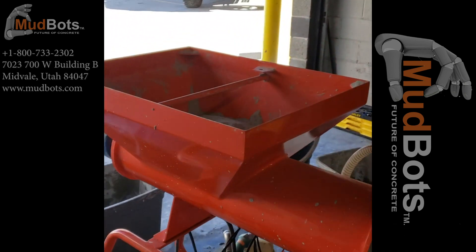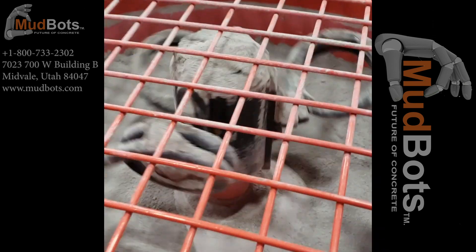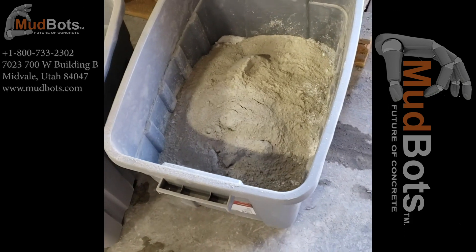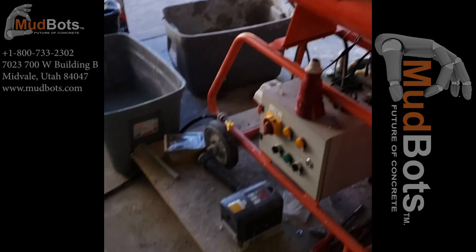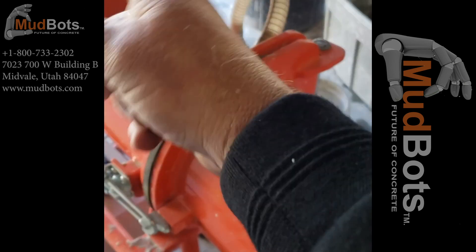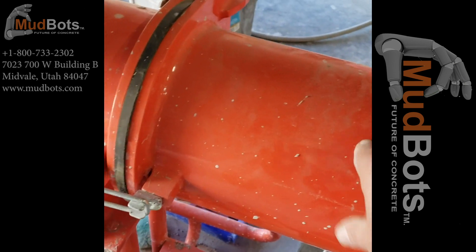Those additives have to be pre-mixed before you go inside your hopper. You can do it a variety of different ways — you can use a standard cement mixer, or you can use a hand mixer like this with these bags as we've shown you. Because of the handles, they're a lot easier to go straight from there straight to your hopper. Here's your water distribution chamber — the mix stays dry, oscillates, comes into the water distribution chamber, water is added and drops out, and goes straight into your pump.